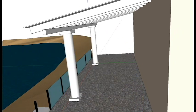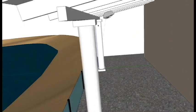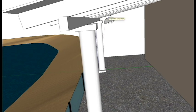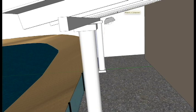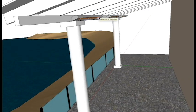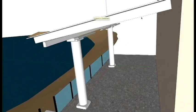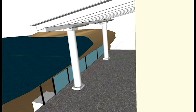I'll go ahead and turn that off, and we'll place some W series Infratech heaters in here. Let's go over the heater real quickly. Here we have a 6-inch clearance from here, and then we have a 6-inch clearance from this edge to the bottom of the structure. These heaters are roughly 51 inches long, and these are WDs, so they have 2 elements inside of the heater itself. You also see that we have them placed in the same locations, 8 foot 7 inches center to center.